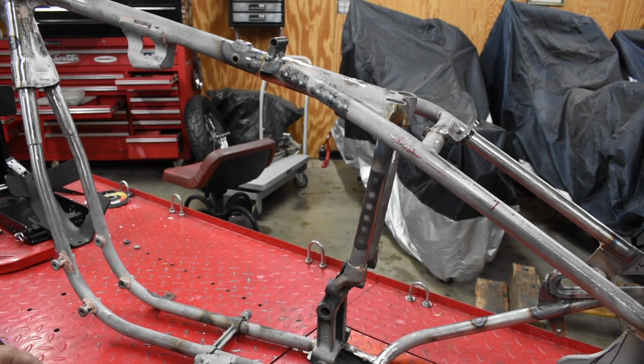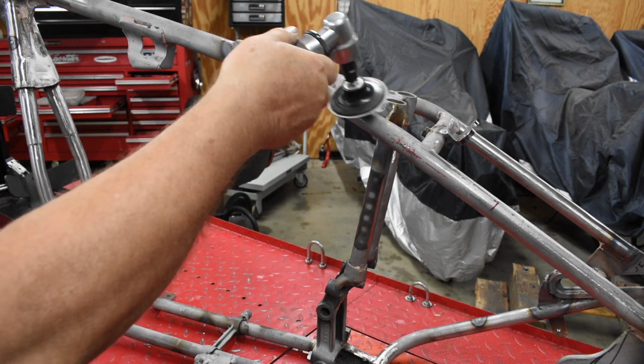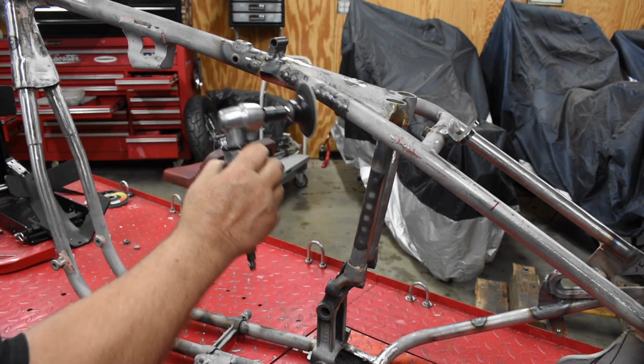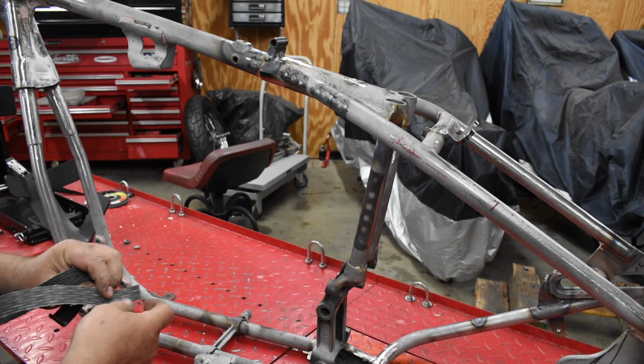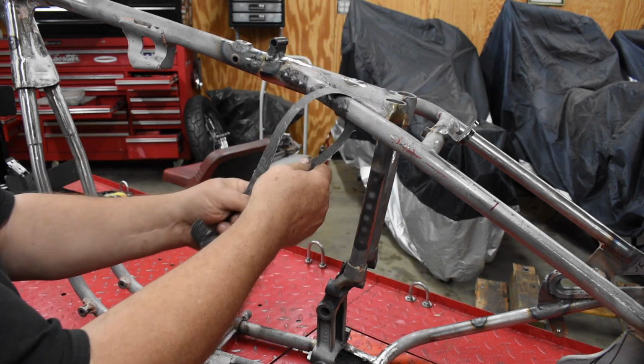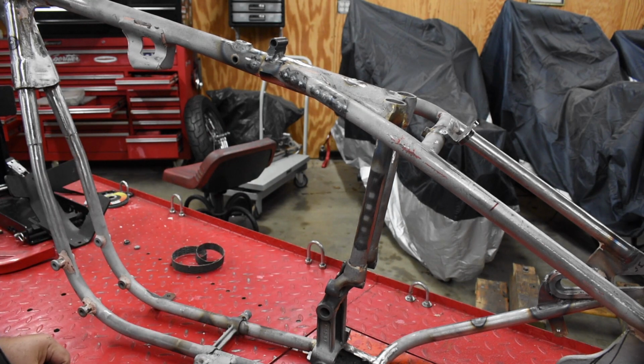The only trouble with that is the grinder is going across, leaving flat spots, and as you're manipulating it around, you're really creating a faceted surface. You can file it, you can dick around with it, a lot of handwork involved. The other way some people deal with it is to get a piece of sandpaper and do something like this with it. Time-consuming, labor-intensive. Difficult to get a good result with that.